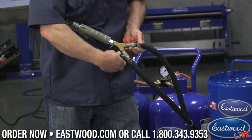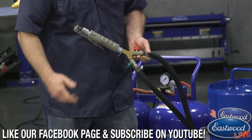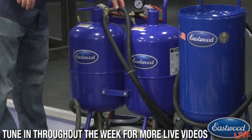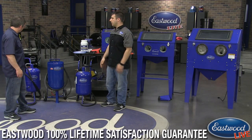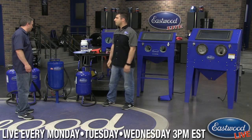You can also mix the two tanks together — set them partway and get your own blend if you need something slightly less or more abrasive for a particular area. Another advantage: if you run out of material in one tank, you can switch to the other to finish the job without stopping to refill. It tends to always run out in the last couple inches of what you're doing, so you can switch to soda and get it completed.